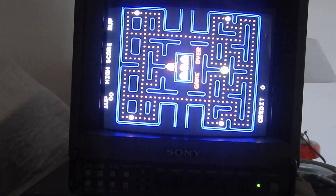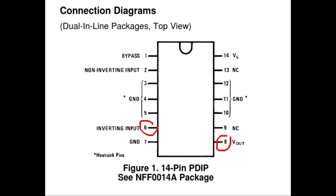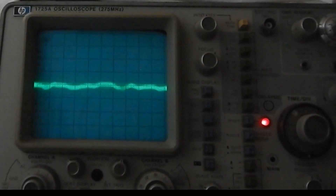I have enabled the rack test with the appropriate DIP switch, and it just advances one level at a time. The sound output, however, is very low. Since all sound effects are barely audible on the speaker, the first thing to check is the final audio amplifier. On this bootleg board, the LM380 integrated amplifier has been used. It is wired as a single-ended input amplifier using the inverting pin only, and the non-inverting input has been simply grounded. I'm going to check first the audio level on pin 6, then the level at the output on pin 8. At the input we have some signal, but at the output we see basically the same signal level, so the IC is bad.